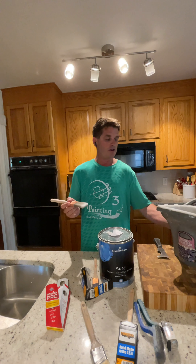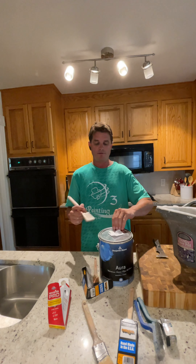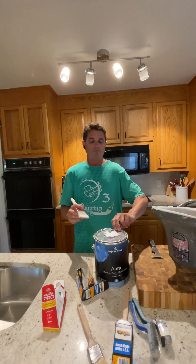I always use a cut bucket when I paint — never paint from the paint can. That's something I see a lot of painters who don't know what they're doing do. One reason you don't want to paint from the can is that if you're painting a room that requires a gallon and a half or two gallons, you have to box the paint — pop all the lids, pour them into a five-gallon container, and stir it up so the color is consistent. Inexperienced people assume two gallons of the same color are identical, but that's not the case — the machine at the store could have put one more drop of black in one can, making it a different shade.